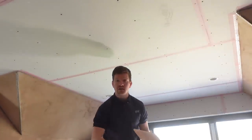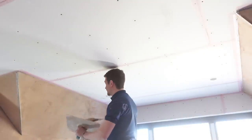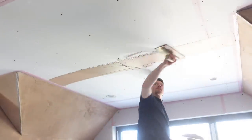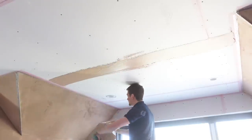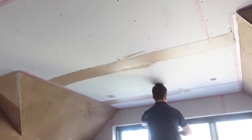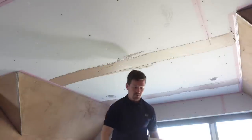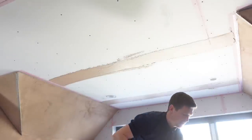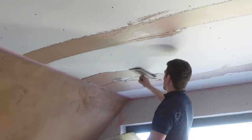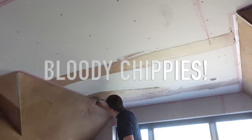I'm going to put these stop beads in and see what it's like working against them — it's pretty new for me. Go over the joints first. We're going to need quite a thick coat to get over these spotlights, something we've got to think about — we'll need two thick coats really. Spotlights are always a bit of a bugger to deal with. Putting a nice thick coat on all over the ceiling, stopping at the stop beads and working around the lights. Actually, I don't think these lights are going to be too bad — looks like this could be alright.